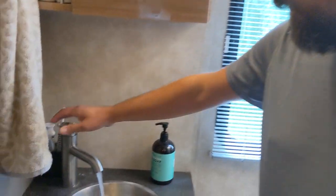A special shout out to Litzen RV. We're using their winterization video in order to drain and prepare, as if we were winterizing, because there are a lot of similarities between sanitizing and winterizing. We have a Truma Insta hot water system, so there are slight differences, and I really appreciate that video. The first step is we're going to try and get as much of the water out of our freshwater tank as we can without having to dump it on the ground, so I'm going to turn on the tap.